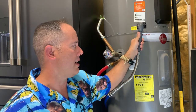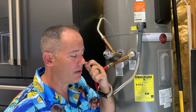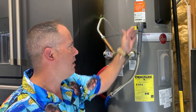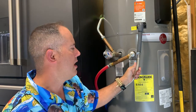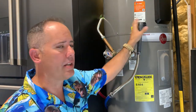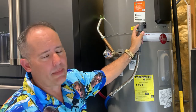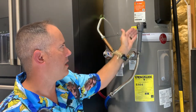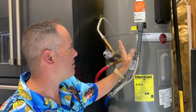If this is hooked up to a condensate pump, check the pump — those do require maintenance every quarter or every month depending on frequency. After using it for a while you'll know the pattern. You'll need to shut it down, take it apart, clean it, put it back together, and return it to service. Shop vac is your best friend — put it in there, suck out whatever's inside, and see if you can get it to drain. A tee right here is recommended so you can treat it with bleach and also confirm it's draining properly by watching the outside wall.